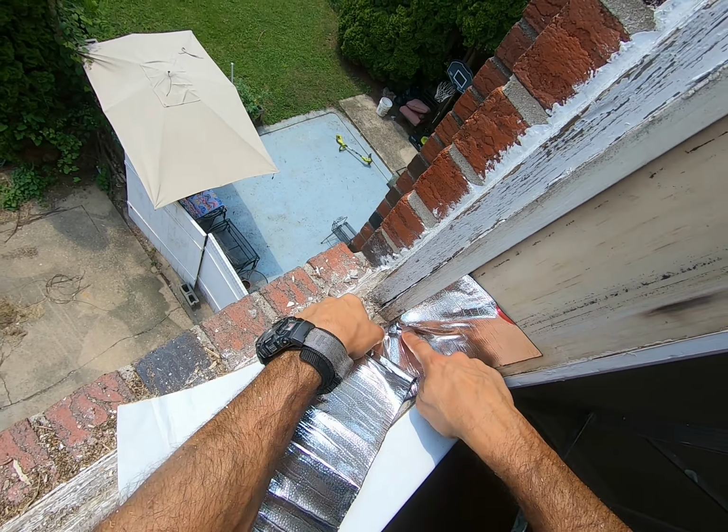Now let me show you what we got here. So here you got, almost look like a nail with this little circular head. That goes into here. And once you tilt it up, it locks into position. And that's how that works. So we're gonna set this aside. We're gonna do the same thing for the top sash. Drop it down, push in and out. In and out, here we go. Same thing. And up and out. Hold on to the hardware.